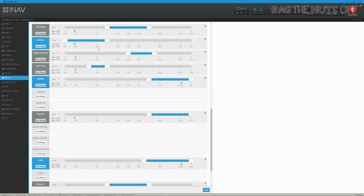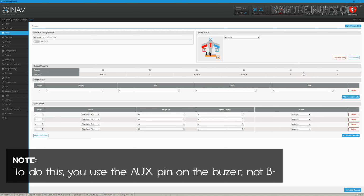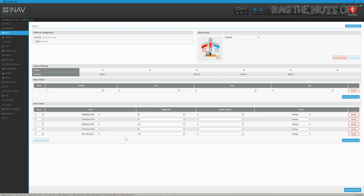Now, actually, before we go, I just want to show you the mixer tab. My bad. If you have a spare servo output like I do within my flight controller, maybe you're flying a flying wing and only using 2 servo outputs, and you've got an additional 1 or 2, what you could do is add in a new mixer rule and change that to servo 5. Then maybe you want RC channel 8 to be the switch. The mixer will now pass through channel 8 to S5, which was the S5 on my flight controller. So when I change my channel 8, which was that switch we saw a few moments ago, we could then connect that up using the auxiliary pin on the buzzer, and that's how we would get it to beep on our flight controller.